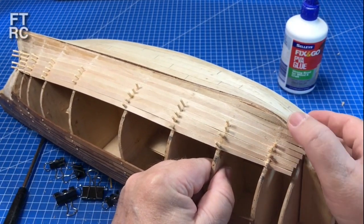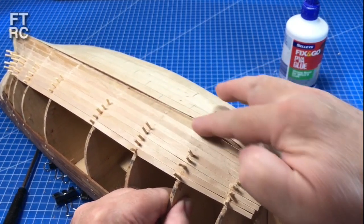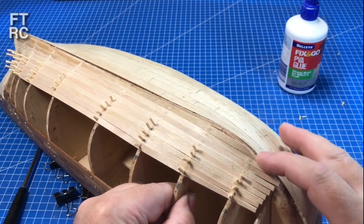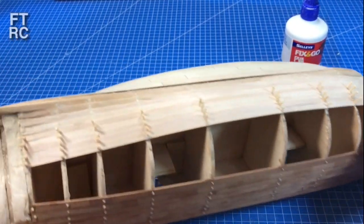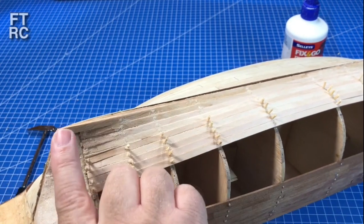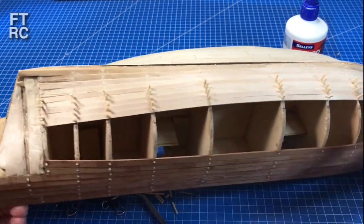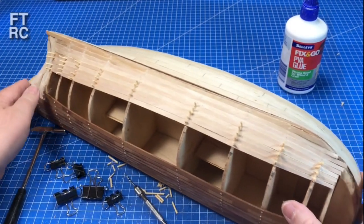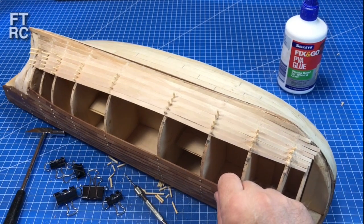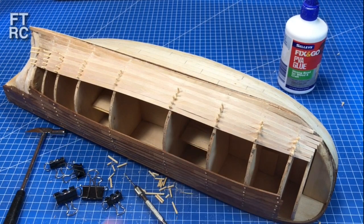At the bow there was tapering, so I explain how I did that. We also have the garboard plank, which is the most important one we lay down first — it sets the tone for everything, gets a reverse taper, and also goes through a 90-degree bend at the stern where it has to angle up to match the rudder. I'll show you all that bending, clamping, screwing and gluing in this video.